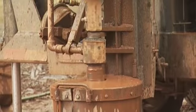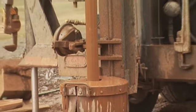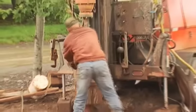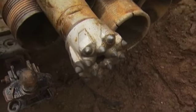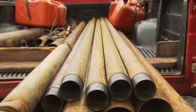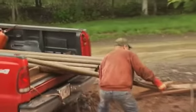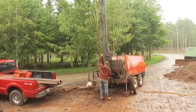Do we need to have a well to pump water out of the ground to get this heat? Initially when we first started manufacturing geothermal units, we were using wells, but the common way today is to use a vertical ground loop field or a horizontal ground loop field. Not everybody has a water well they can use, so ground loop fields have become more popular. A horizontal ground loop field might take half an acre, whereas a vertical ground loop field can be done on anybody's lot — wells are spaced about 25 feet apart, taking only about a hundred square feet.